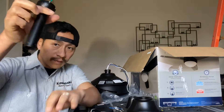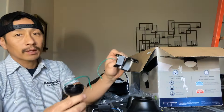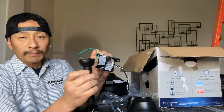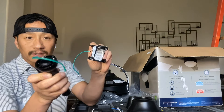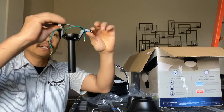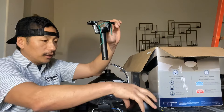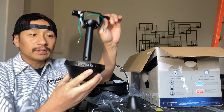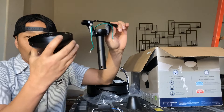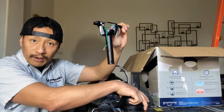The key is to get this piece mounted first, and that's all you got to do. Then come back in here with this mounted with the motor, pick the whole thing up, climb the ladder and drop this little ball into the socket. Let the ceiling hold the weight of the fan while you're doing all the electrical stuff. And then you've got all these trims to hide all the wires and things like that. So that's what we're going to do right now.